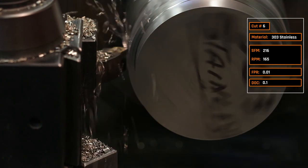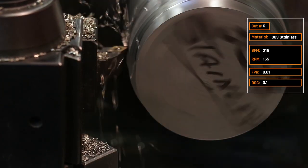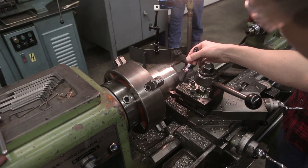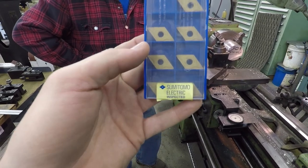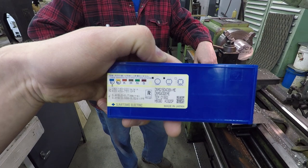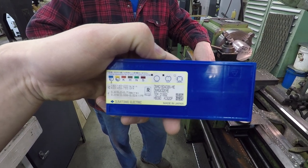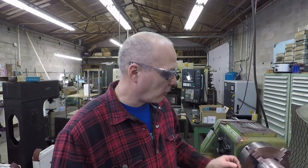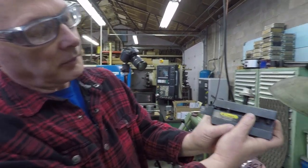What Paul was noticing with the doubled feed per rev was a really tight chip, which can actually strain the insert and shorten tool life — it was working but probably a little past the point of efficiency. Now we're switching to a negative insert: a Sumitomo DNMG 432 EME. It's a bigger IC — a bigger insert — mainly because Paul uses the smaller positive inserts for fine cutting on CNC where there's less cutting pressure.